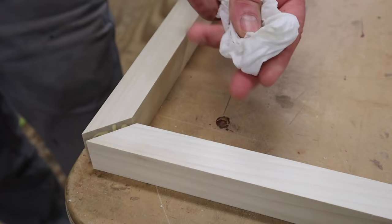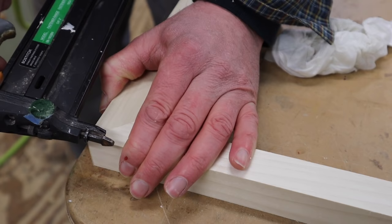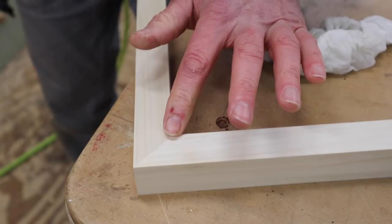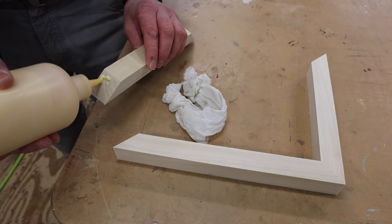When I make this frame I'm using one inch nails and wood glue, and I've got a wet rag here. I'm going to wet my hands so I can get a good grip on the molding and clamp it with my hands. Because the nails are only one inch long I don't need to worry about hitting my index finger. I've got the miter clamped nicely — that's a nice tight miter. Beautiful cut.